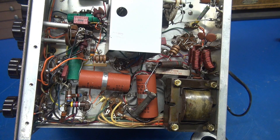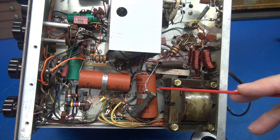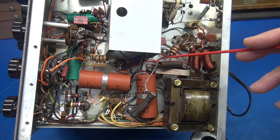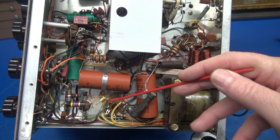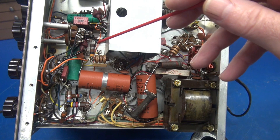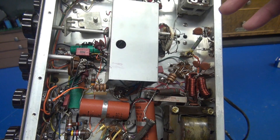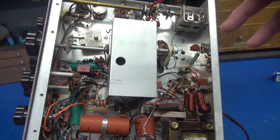On the bottom of the chassis, I noticed a few things right off the bat. There's an added resistor here, a big old carbon guy, and there's a 20K resistor here. It appears as though somebody was making some type of a voltage divider. Here is a diode kind of hanging in the breeze, and here is another resistor kind of hanging in the breeze. And up here I notice some other modifications by the OD3 voltage regulator tube.